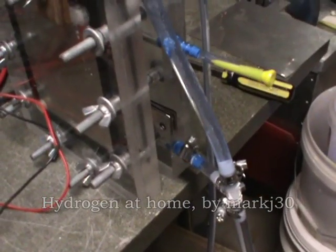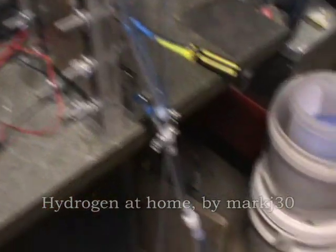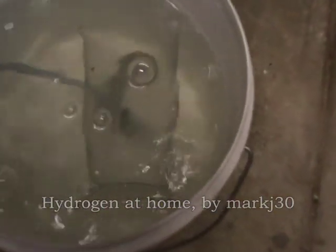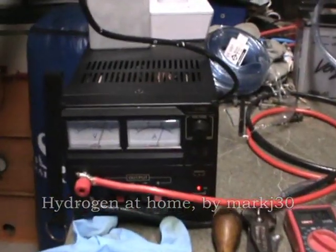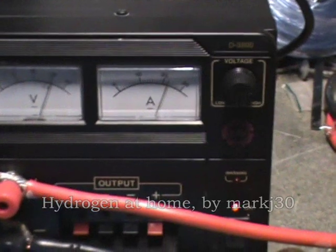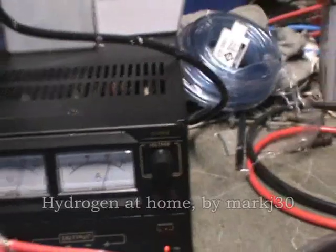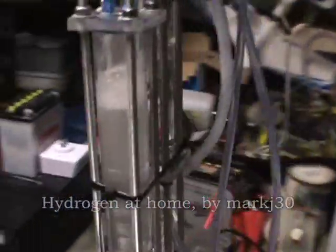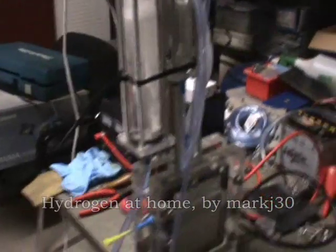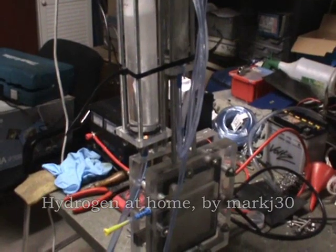This is set up in neutral plate configuration and the next one won't have any neutral plates in it — I'll go into that on the next video. It's probably putting out about a litre and a half right now, or maybe a bit less, 1.3. So it's quite capable of putting out one and a half litres like this, and I suspect the full size unit should be able to put out about 10 or 12 litres a minute. Time will tell — I'll talk to you all soon. I'm going to run inside before I get drenched, so I'll see you later.